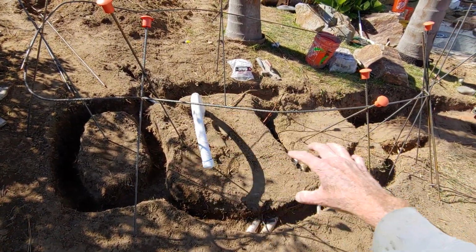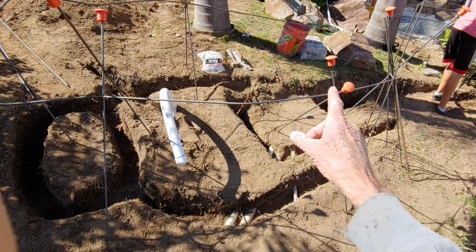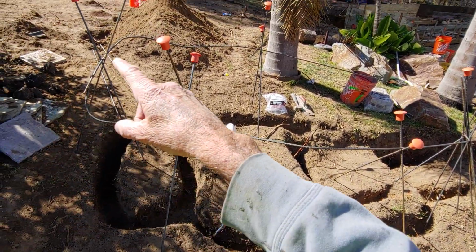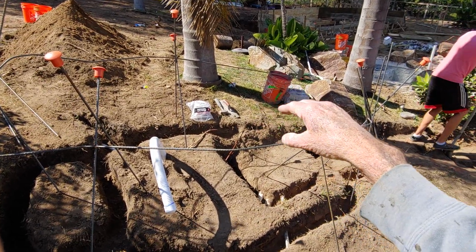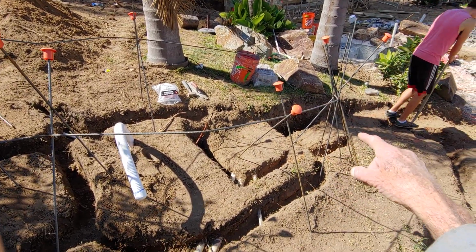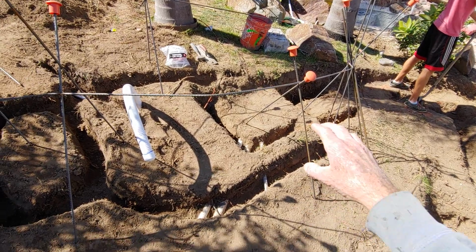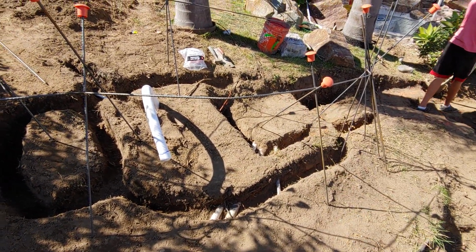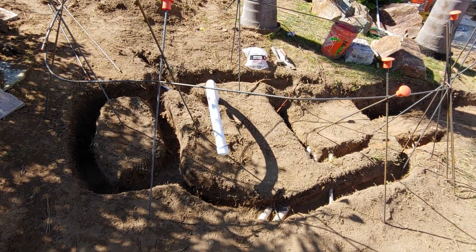So this is our little starting position, and again, I just wanted to outline that we put these crisscrosses, you put a piece of rebar above it. We'll continue that one, it stops right there, but we're going to bring that on down when these other trenches are ready, and we'll just pour them all up, set in the rebar, tie it off right on that piece of supporting rebar, and you will be good to go.